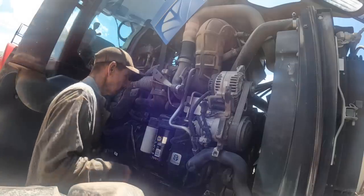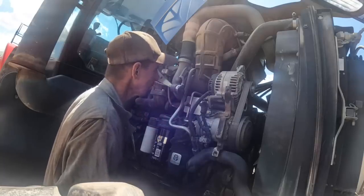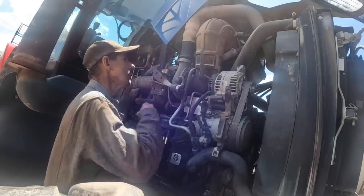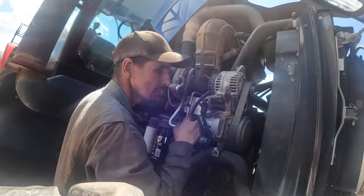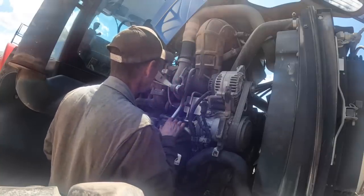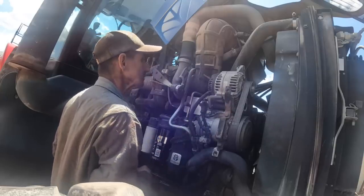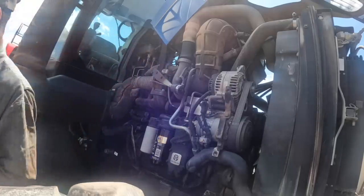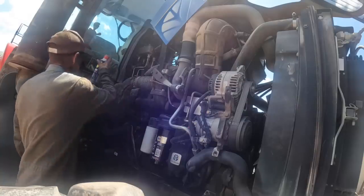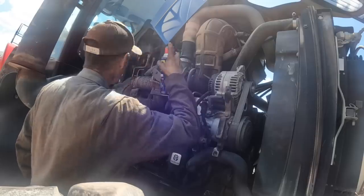Okay, I don't want to discharge the AC system at all. I'm going to really try to avoid doing that. Let's see here. Charger cooler hose off the turbo. Where is... Wow, they really cocked that weird. Way up here like that. That's really odd. Why'd they do it like that? And go get a socket for that. This exhaust probably wouldn't hurt to soak them all around.